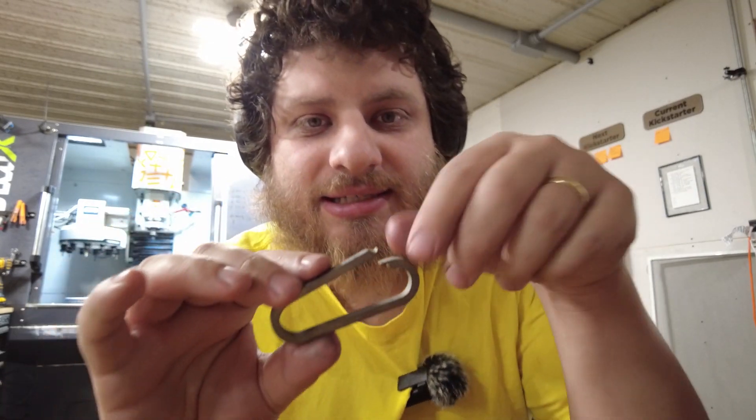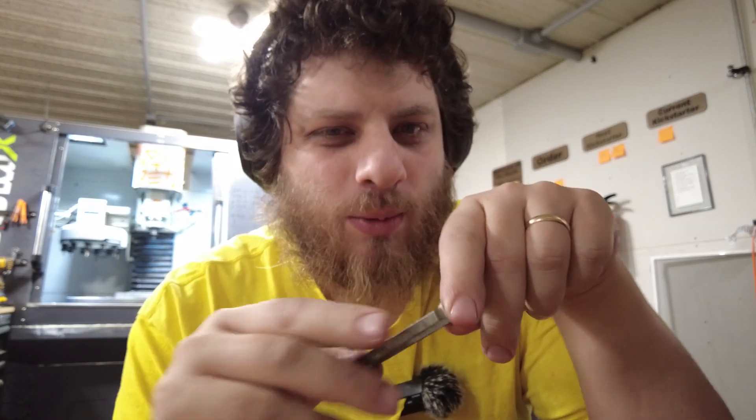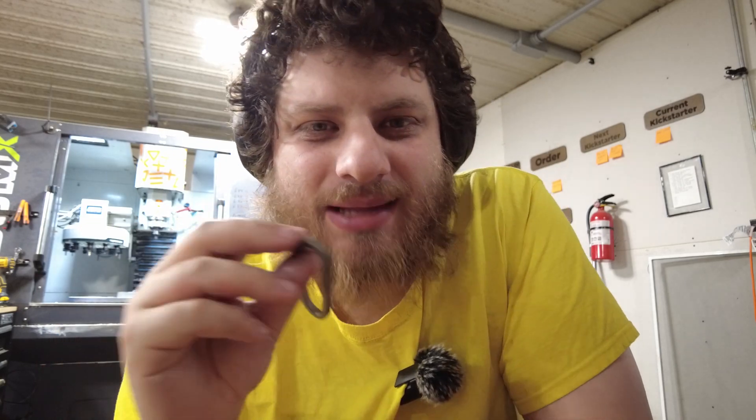Most of my problems come down to one thing: I designed a bad fixture. My fixture was dependent on these laser cut blanks being more consistent than they are in reality. When I was ordering in small quantities, the size range was fairly small, but now that I have a thousand of them, the tolerances have opened up with volume. I'm using a UV curing adhesive work holding, which is nice because it doesn't add any forces or distortion to the part — but the downside is it doesn't help you locate the part at all. My clamping is separate from my locating, so while I'm getting work holding forces, I'm not accurately positioning the part.